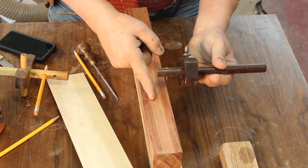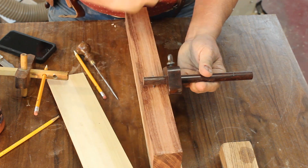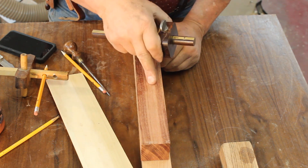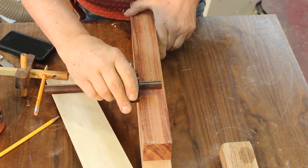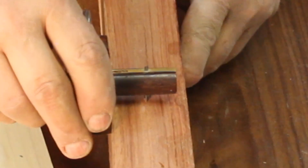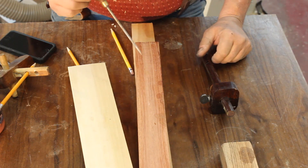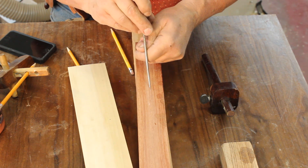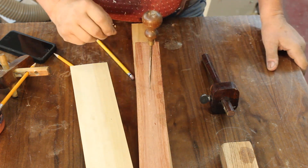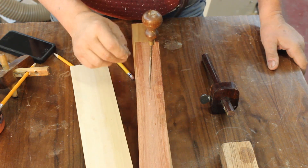If I want to mark the center of this piece of bubinga, I'll just get that close by eye. One approach I take: I'm not real concerned about getting two lines right in the center — that's not always the point. So I mark right in there, turn it around, and you can adjust your tool and get closer to the very center. For some applications this is good enough. I'll just take my scratch awl and eyeball that — there you go. I may be off a 64th of an inch; it doesn't matter, though maybe for some things it does.